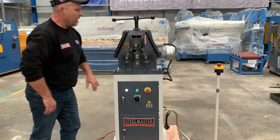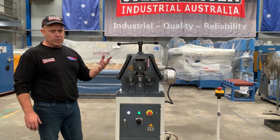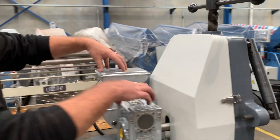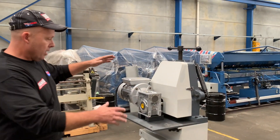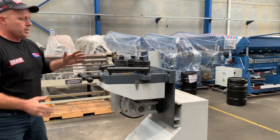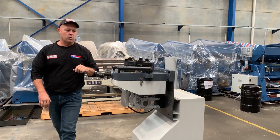Let me show you the key feature of this one here. I've already unbolted these bolts and loosened it off so we can actually bring the head back. It's a little bit weighty, but if you come around the back, we've got a heavy-duty gearbox here. This gearbox operates the machine in both modes. So you grab that and pull this back here and put it into horizontal mode. Just imagine doing massive rings and big diameters by having that back there — this gives you a very, very good flexible setup.